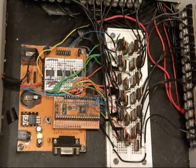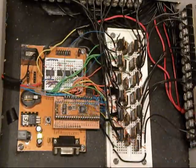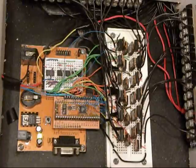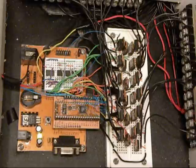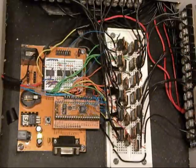Next, the electronics. Controlling the entire mechanical assembly is a Basic Stamp microcontroller 2P40. The 32 I/O pins are enough for each of the 25 notes, plus push buttons and LCD display. Each solenoid requires a separate transistor because the microcontroller itself cannot provide enough power.